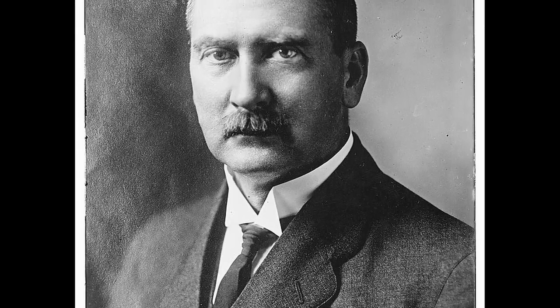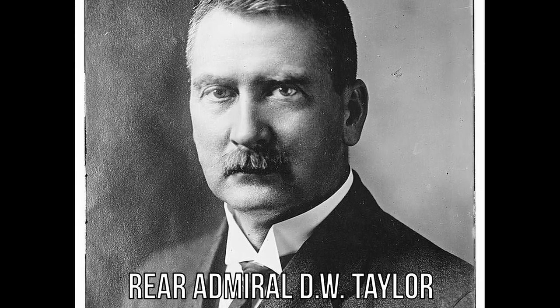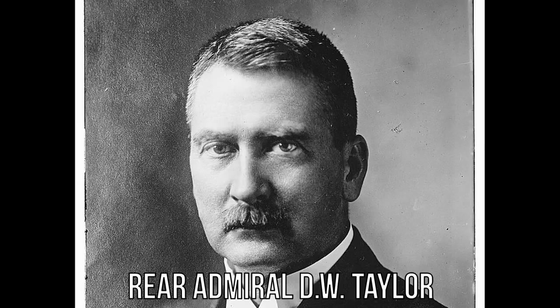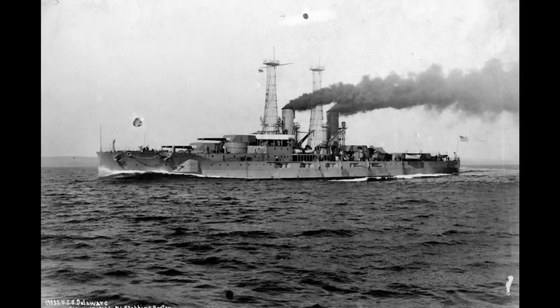As the 20th century rolled around, Admiral David W. Taylor of the US Navy was finding through repeated testing of the Ram bow that it had some impact on reducing wave-making resistance. This led to the application of a very early version of the bulbous bow called the Taylor bow to the USS Delaware, which entered service in 1910. It was discovered that the ship had much lower wave height compared to existing hull forms.